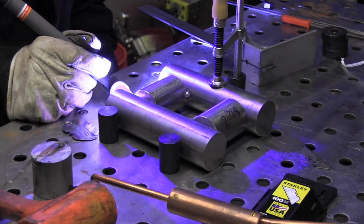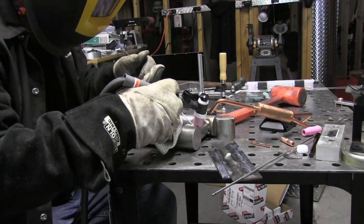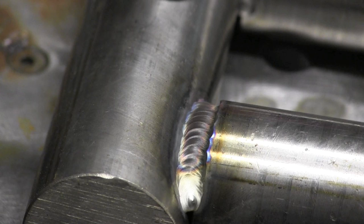This is not thin stuff here. I'm cranking it up now, lighting it up on inch and three quarter thick metal at 175 amps. I'm going to be pouring the coal to this little thing because it's going to take a lot of stress — I'm going to put it on the bottom of a Harbor Freight 20 ton press and bend weld test specimens with it, so it's going to take a beating. You can see I'm just washing the corner of that stainless into the weld as well as filler metal. That's the first pass, then I'll come across with a second pass. I've got a little bit of a bad torch angle there — that's why it's kind of undercutting at the top of the weld. On the last pass I'll fix that and push enough rod in there to eliminate any undercut. A total of three passes — it could have even been four. It's a lot of weld metal, a lot of penetration, but it's going to take a lot of stress when I'm pounding on bend test specimens.